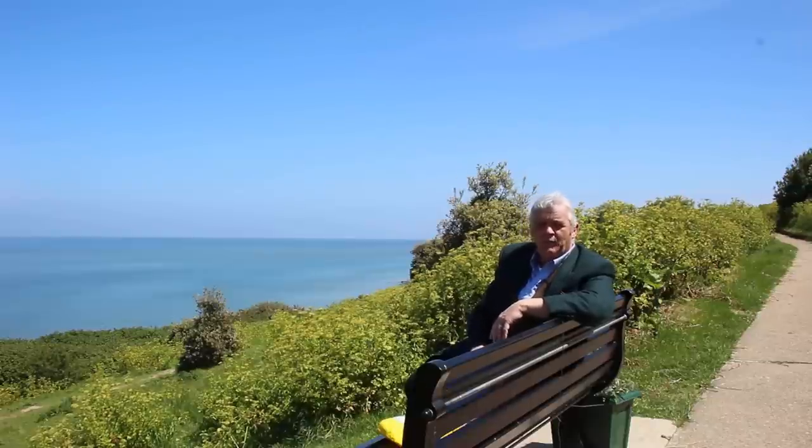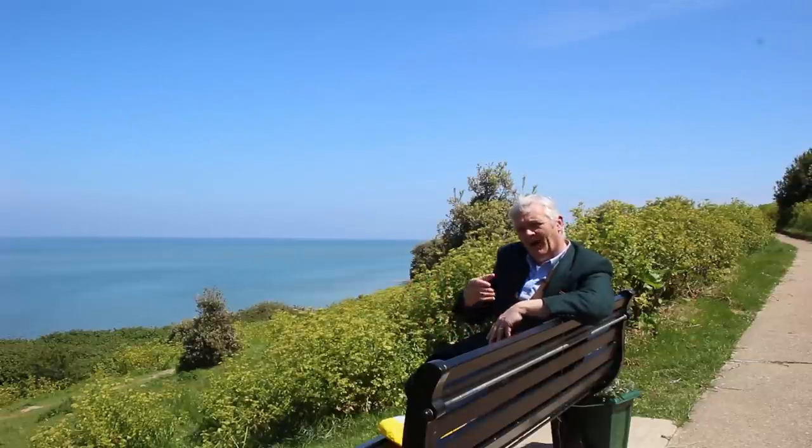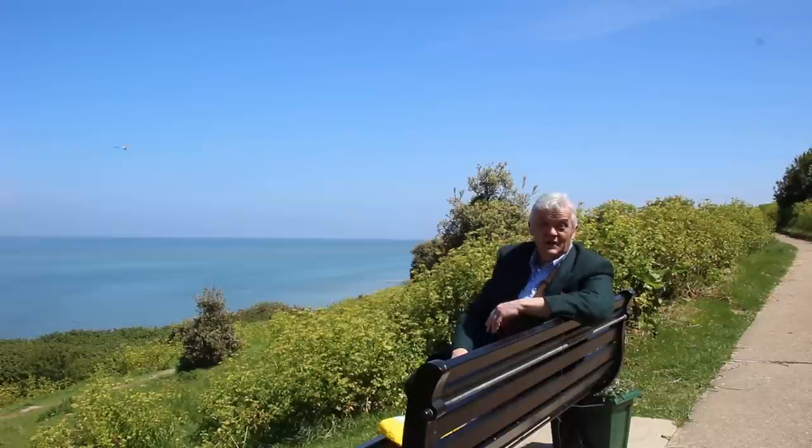All you do is take a piece of copper pipe, cap one end, put some acetone in it, heat it gently until the acetone is steaming, crimp the end, let it cool and you've got yourself a heat pipe. What happens is the liquid at the bottom is cold; when it gets hot it evaporates into the top as hot gas. That hot bit is put into a container of water and starts to heat the water, it gets cold and drips back down — a heat pump with no moving parts. The lifespan of a heat pipe, which is also incredibly efficient, is years.